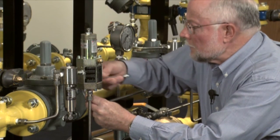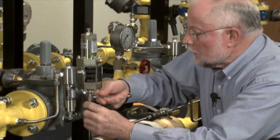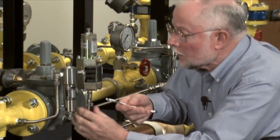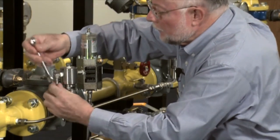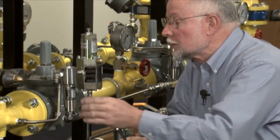I'm going to disconnect this tubing. I've got a bleed line here I'm taking off. Also down here is a control line, and as you can see both of these lines go downstream. Over here is another line which goes to the upstream, and by taking this off first it ensures that I have no pressure left in the system.